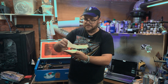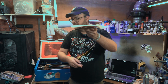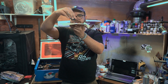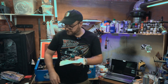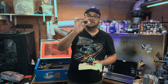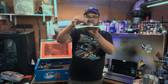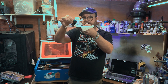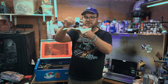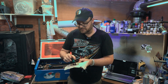Let's use a piece of cloth here like this — you can see it's not straight. Imagine this would be in the laser and the laser head would be at this height more or less. I found two big glass marbles from my childhood and they're designed to fit in the bracket here. When this thing moves over the cloth, it pinches down the cloth in the area where the laser cuts it, so I can do relatively straight cuts.